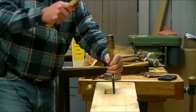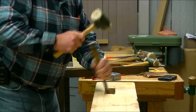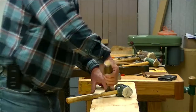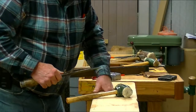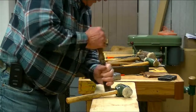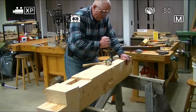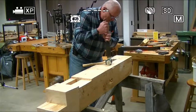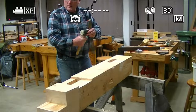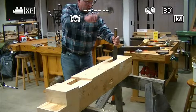This is fighting me a little bit in the mortise because I'm actually chiseling into a knot, which must be coming up from the bottom. Though I can feel it's a little more difficult, it still comes out pretty easily. You may wonder why I'm using a leather-faced mallet. You can use a wood-faced mallet, or make your own. I found that wood mallets transmit the force I'm exerting onto the chisel right to my elbow — all that shock goes right there. By using the leather face, you have this cast body that gives you the weight, but the leather face absorbs some of that impact. I don't feel it in my elbow at all.